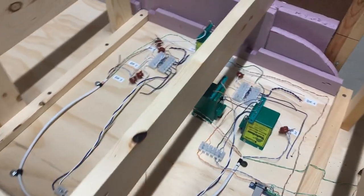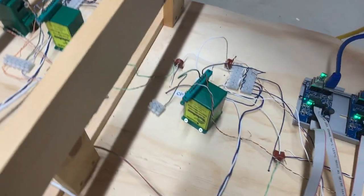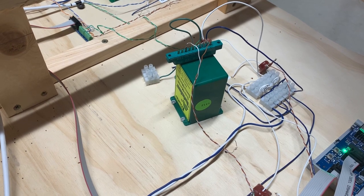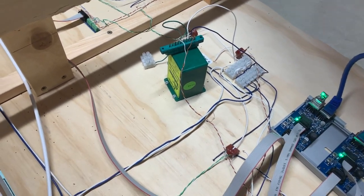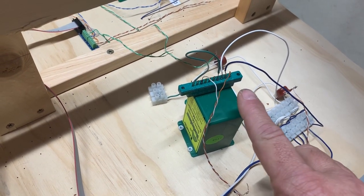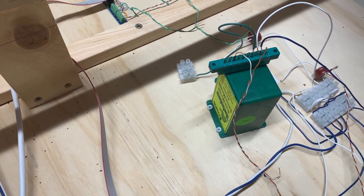So I hooked them up, and my first three tortoises I had zero problems with. No problems whatsoever. I put the edge connector on. Everything worked like it was supposed to, other than my lights. And then I got to this one, which I think I mentioned in my last video. And all of a sudden it stopped working, and I was getting a dead short on the layout. Well, after I messed around some more with the LEDs on the panel and kind of gave up on it a little bit, I came back and tried again, and I couldn't find anything wrong with the edge connector. But then I finally figured out that this can slide too far left or right. In other words, the corners of the edge connector themselves do not line up with the corners of the tortoise.